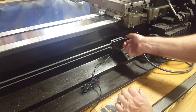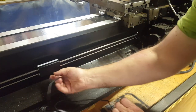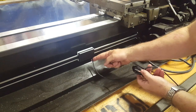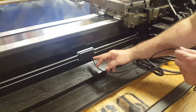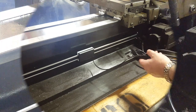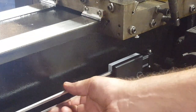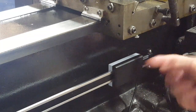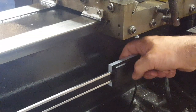We've got our scale and sensor mounted up — you can see it slides back and forth. I've got the cable routed down rather than up because I was worried about it rubbing the underside of the carriage. I'll wrap it up and around to where it's going to be mounted. Next I need to take some measurements to see how far the bracket needs to go back and down to hit the mounting screws.